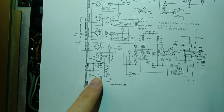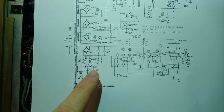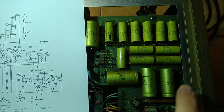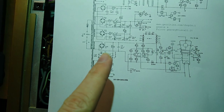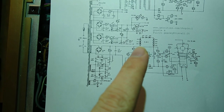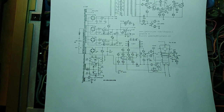It's this one. And if you have a look at the power supply, you see that with those two diodes, this capacitor and those two capacitors are a voltage doubler. That's another voltage doubler, and that's a third voltage doubler. So this block, which corresponds to all of those capacitors, is a voltage tripler that starts from a secondary tap of the power supply and generates, well, I don't know what kind of voltage this is, but here there are 10 180-volt Zener diodes, so this is 1,800 volts, so it's probably 2,000 or something volts in here. And this part was sparking.